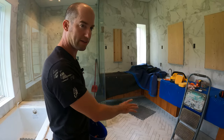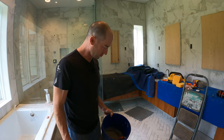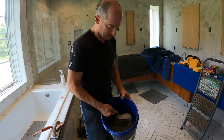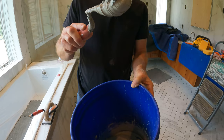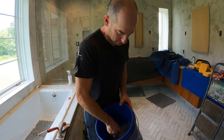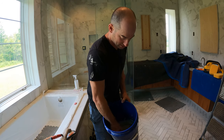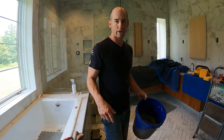You can see I have to tile all this floor behind me, so we're in here ready to go. It's been about five minutes, so I'm going to do a hand mix — you want to hand-mix for one to two minutes. You can see the consistency again, how it holds up — it's going to spread nice and smooth. Depending on your conditions, this can last up to 45 minutes. It's ready, so I'll start putting it on the floor and working my way out of the room.